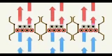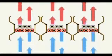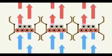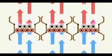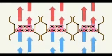The first set of coils may be continually operated at high volume, removing the possibility that the volume of steam may drop to a level that might promote freezing. The second set of coils may be completely deactivated until required volume or temperature rise exceeds demand for the first set of coils.